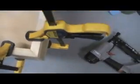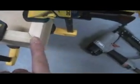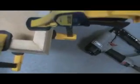Now I'm assembling the collar pieces by clamping them to a flat surface that has a square corner. I clamp it on its edge, make sure it's tight on both sides, put a little bit of glue on the joint, and then put some finishing nails in — in this direction and also on this side. I'm using a pneumatic nailer, but you can use regular finish nails and a nail set.